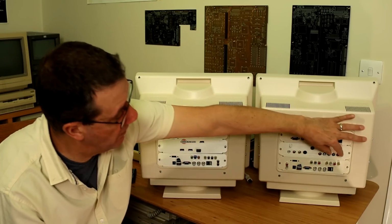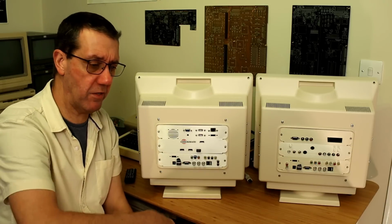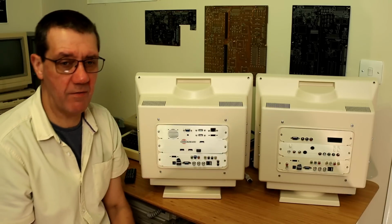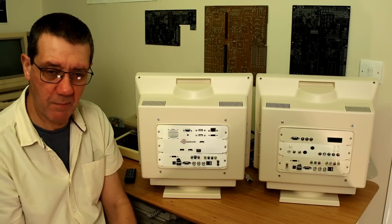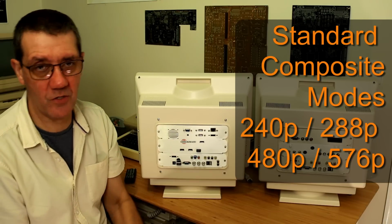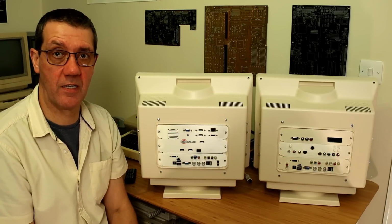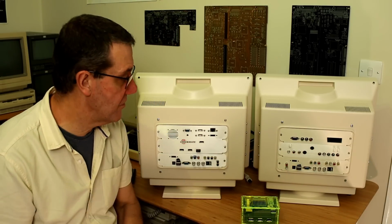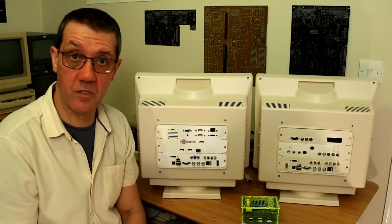As you can see, there's a component here, there's a component there. So if you've got interlaced signals, this is fantastic. I basically have a component output for my Amigas. They plug into here, and as long as I leave them in interlaced mode, whatever I'm doing, it's perfect. If you're going to drop down to run demos or games, you need to switch back to composite. Now you're going to see later how good the composite on this is. It is actually really, really good. You do have to drop back to composite for non-interlace. So if you're using an Amiga and you want to go interlaced via component, it is fantastic. And if you're playing demos or playing games, then just switch it straight over to composite and you won't be disappointed.